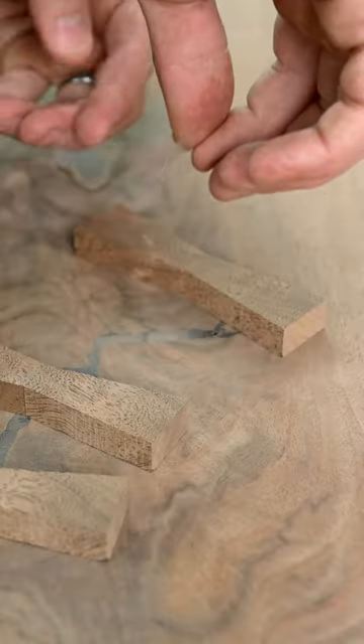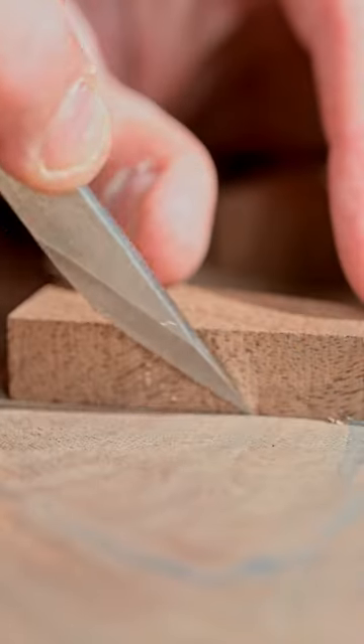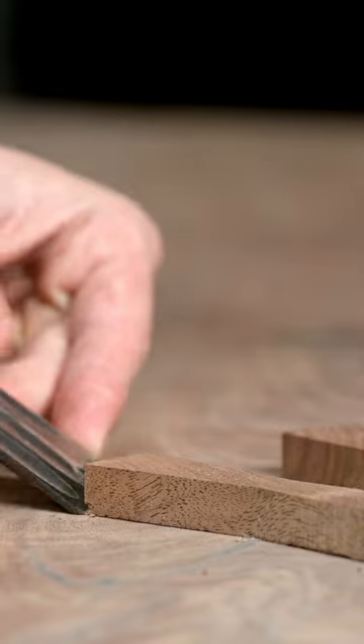I get some rectangular pieces of wood — the size doesn't really matter. I made a simple little jig that I cut them out with my band saw, then double-side tape them down and just gently trace around them with an exacto knife or a marking knife like I have here.